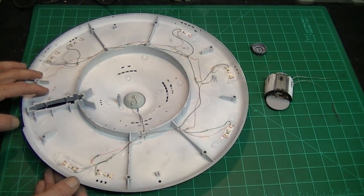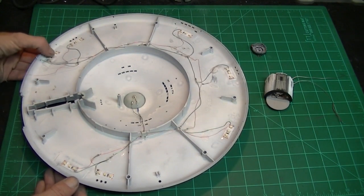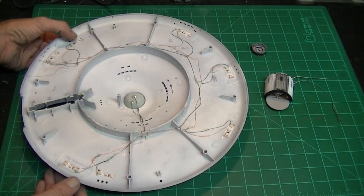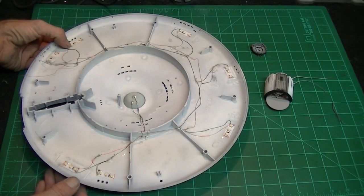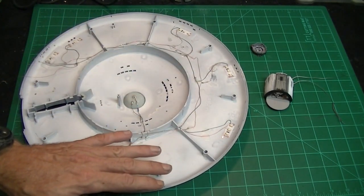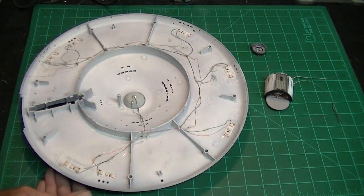Well, I tend not to like to use that type of circuit for a really important reason: if you have a failure anywhere on your circuit, whether one of these LED strip assemblies goes out or you lose a connection, say the wire comes apart over time, anything beyond that point will no longer be able to receive power, since it will no longer be a complete circuit.